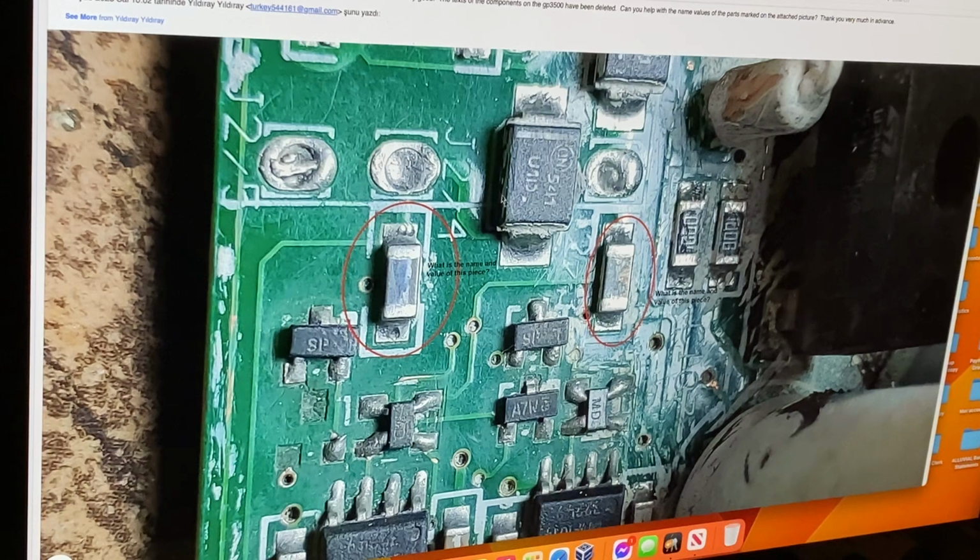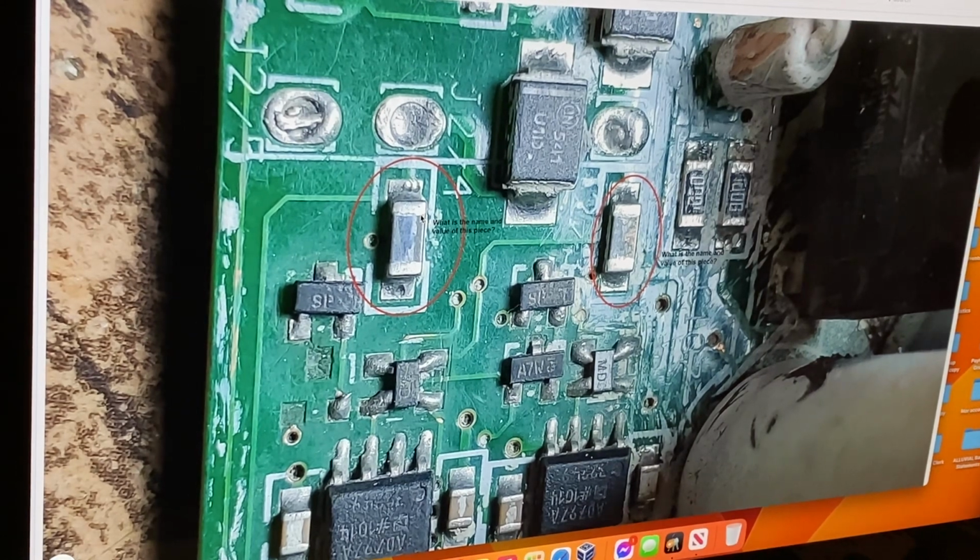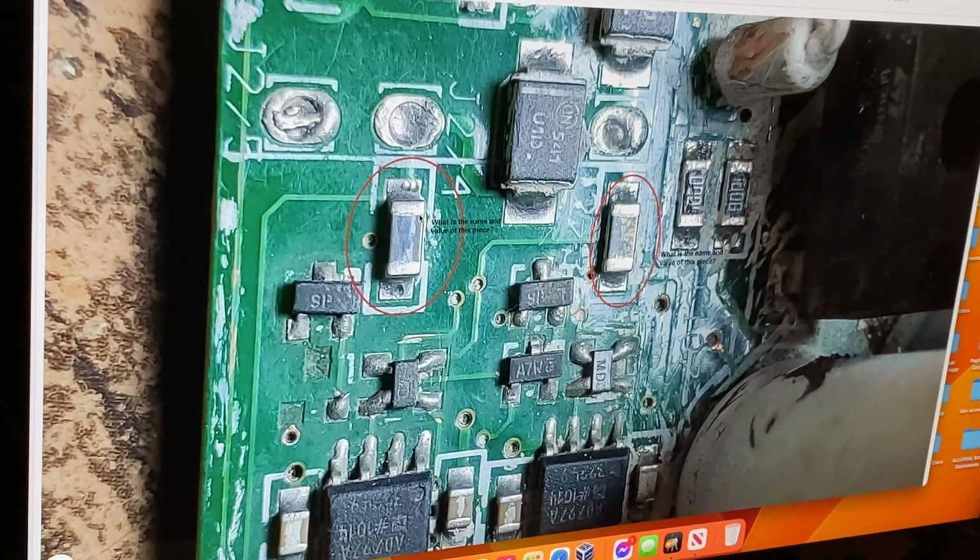Okay. He's obviously scratched the paint off his detector, so he's trying to fix it. I don't know if you can see the mouse. Yeah, you should be able to see the mouse pointer. He's got these devices here circled, and that's for both receive input channels. These are part of the circuit, and they connect to the receive input stage, and all they are is inductors. I think they're about 1 microhenry, half a microhenry, maybe too much in one of these detectors if it's running very fast timing, such as if it's got extra modes or anything.